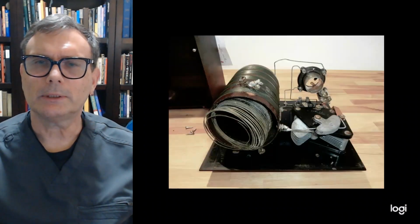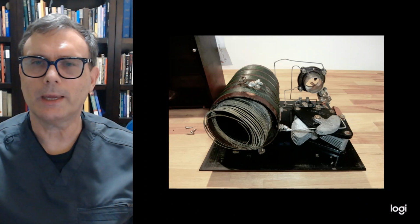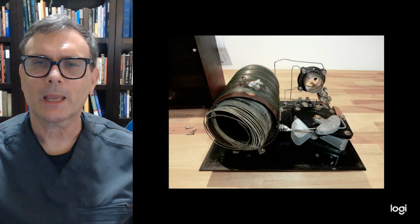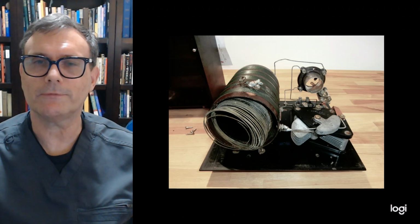And internally, the biggest issue is that variocoupler. As you can see, there is quite a mess there with the unraveled wire on the ball coil. In addition to that, the rheostat is actually open, so the nichrome wire needs to be replaced in it. But other than that, it's pretty intact and everything is definitely fixable.